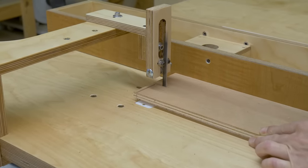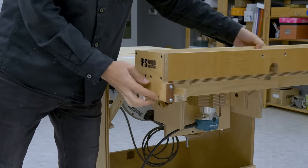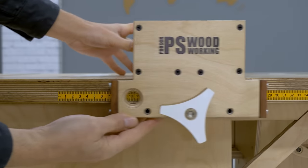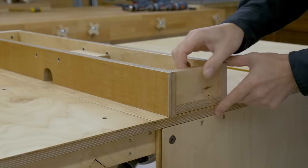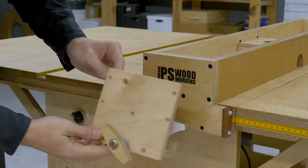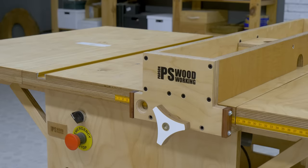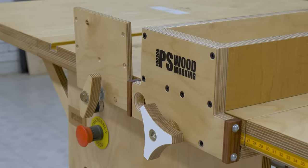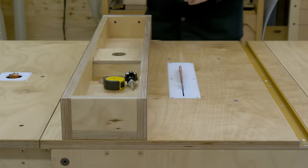In this first video, I'll show you how to improve the fence. This is a very simple fence that's inserted in one of the sides of the table saw. I've screwed a small plywood piece to the back side in order to make it sturdier and ensure it's square with the top of the table saw. I've also made a new front piece that's a little longer on the bottom to achieve a greater support surface. This time I've used 18mm thick plywood rather than 9mm. It still has some slack at the end point of the cut, but this isn't a problem.